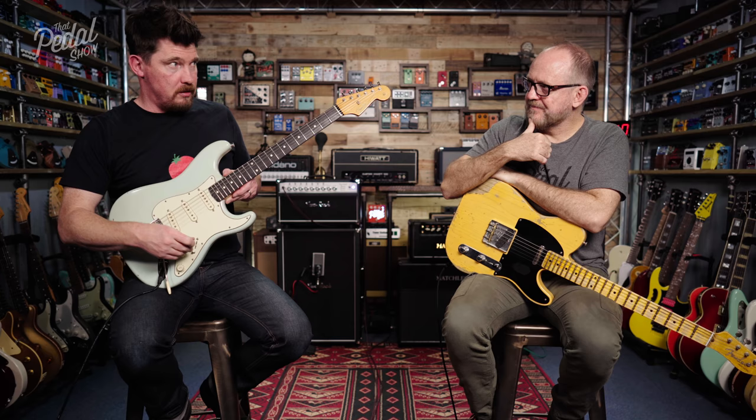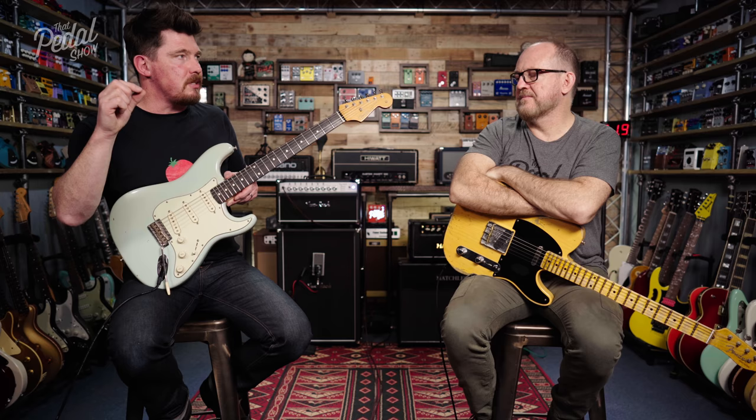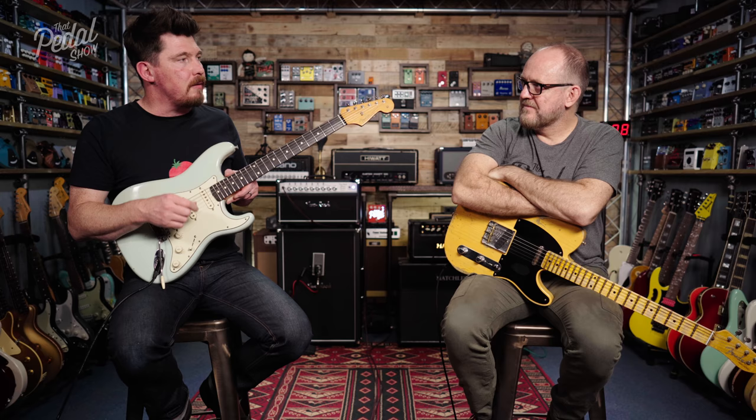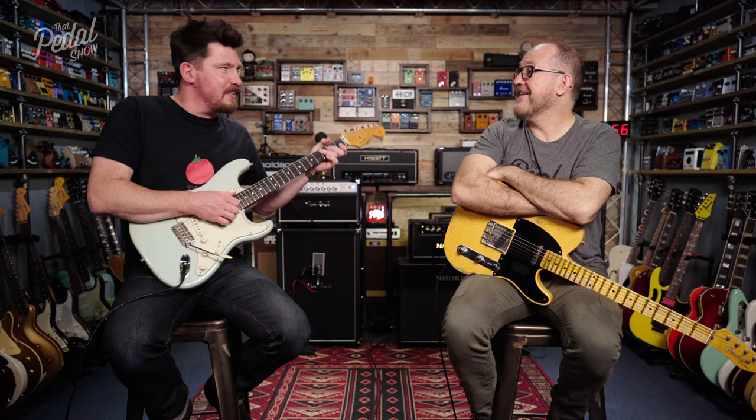0.047 rolls off more upper mid frequencies. And if you go to a 0.022, you'll only roll off those really high frequencies. So if you want to use it for high gain, a smaller cap can really help with that. But yeah, they can rock. They can rock. Yeah, yeah. Very cool. If my demonstration doesn't quite work out, go and watch Yngwie Malmsteen or Ritchie Blackmore. There you go.